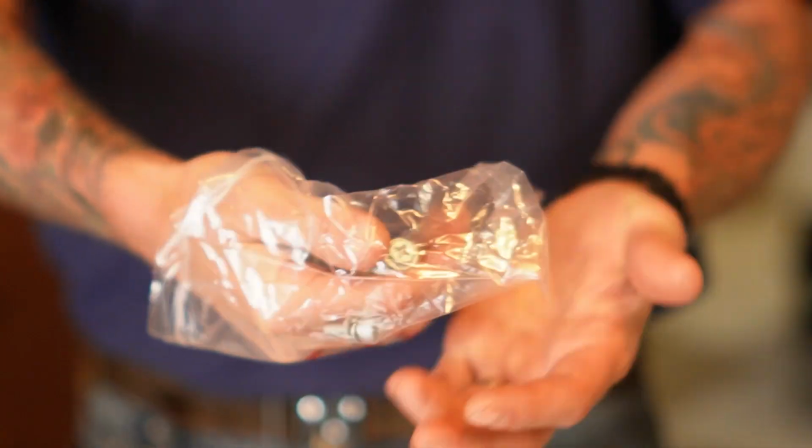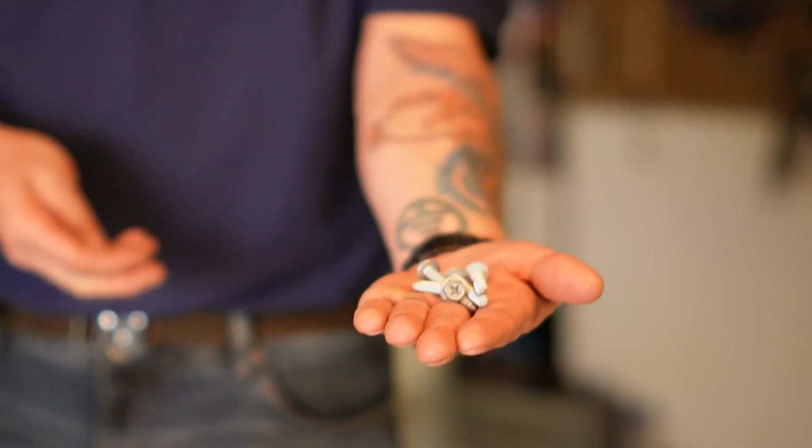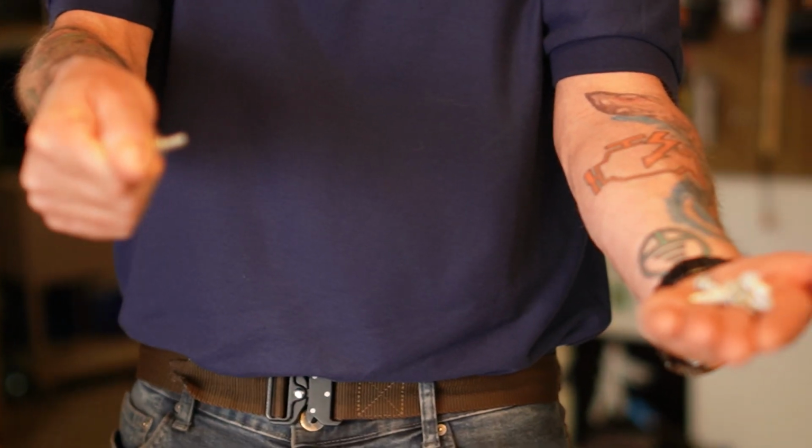This is an FCC required device. In order to comply with FCC, MidNite and every other transformerless inverter requires these toroids to meet noise emission requirements per FCC. That one's for your battery cables. This one is for your ground connection to your ground rod. So this connects the bracket to the wall. Once you get the inverter in place, this screws into the side to make sure that it doesn't move anymore. I think that's it. And then we're at the inverter.